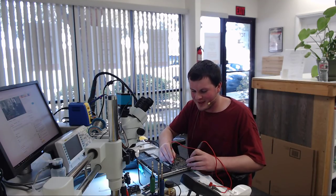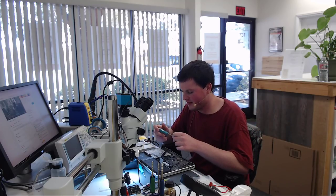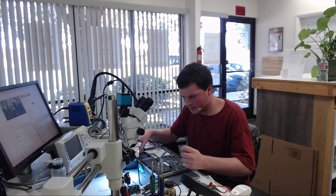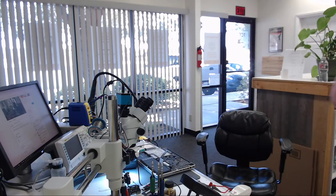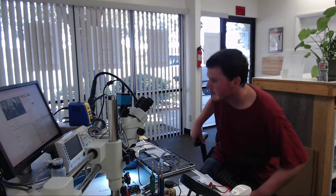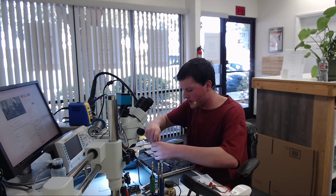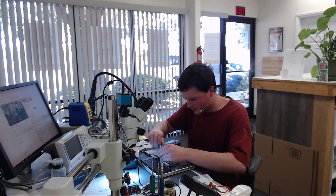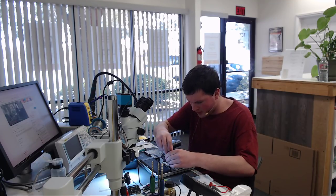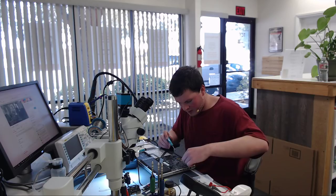And we get 12.26 volts, which means our SMC is not running, which is my favorite repair. Okay. T6, we need another screw holder. So this one goes with this machine, and slot one is open. Poor SMC. Poor SMC. Hopefully, I don't have to reball an SMC because I have to leave in 15 minutes. So, if it is the SMC, I'm probably not going to be able to do it right now. I have to do it later. But when I come back, I'll stream.